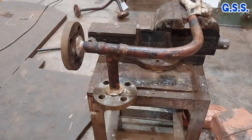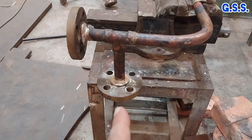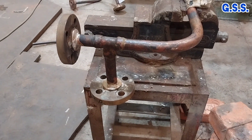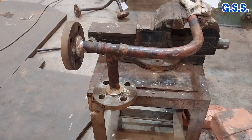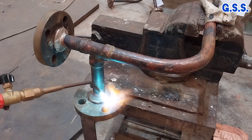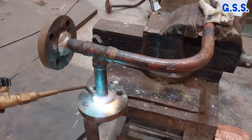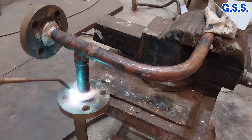We found leakage through the body of this brass flange. Now this brazed brass flange will be removed from the copper pipe by keeping it in a vertical plane and heating it at about 800 degrees Celsius, so that the brazing will melt and the flange will fall down.